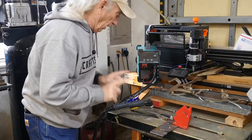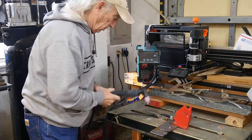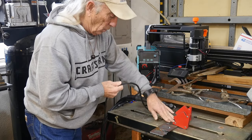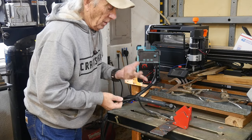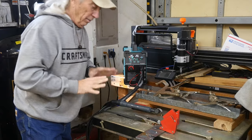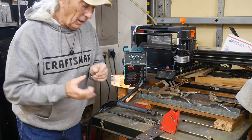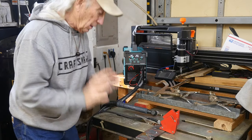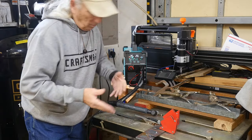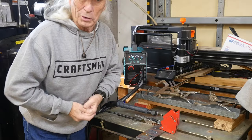We're set up to cut. The torch cable is about 10 feet long — pretty good. The ground cable is about nine feet, so you can have the machine pretty far back from your job. On 110 you can't cut as thick, so your settings will be more limited. The 220 is a stronger setting — that's always been the case, and it just makes a stronger machine.